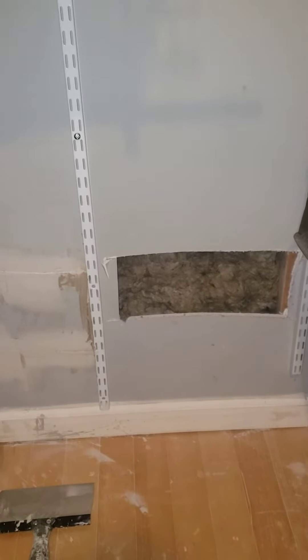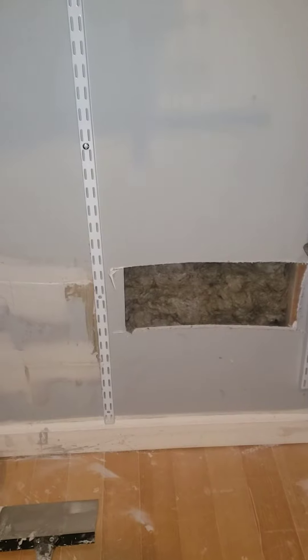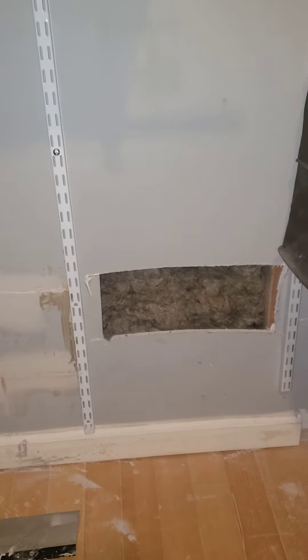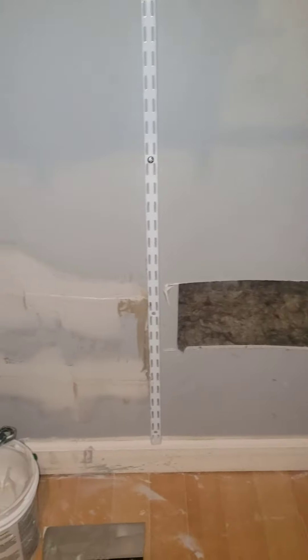Here is tonight's project. I wanted to do something about soundproofing the walls to the master bathroom. Since the walls are already up, I decided the method I was going to do would be to cut out little pieces between each 2x4, shove the insulation up the wall, put those pieces back as well as I could, and then mud over them.